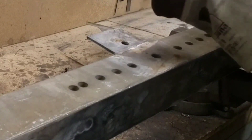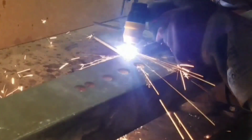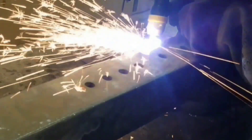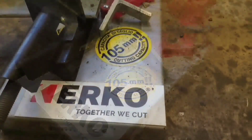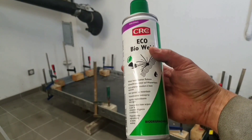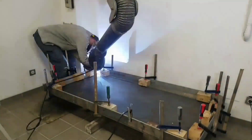Here are the reclaimed angle irons. There was a small bent section I couldn't straighten, so I preferred to cut it off — I don't need that piece anyway. On the top surface there are quite a few holes that won't bother me, but on the front face there were also holes that I filled back in by re-welding, just to keep it clean. I'm making more cuts for the angle irons that will form the frame. I'm clamping and tacking directly on my plate, and to avoid spatter sticking to the plate I apply anti-spatter spray.